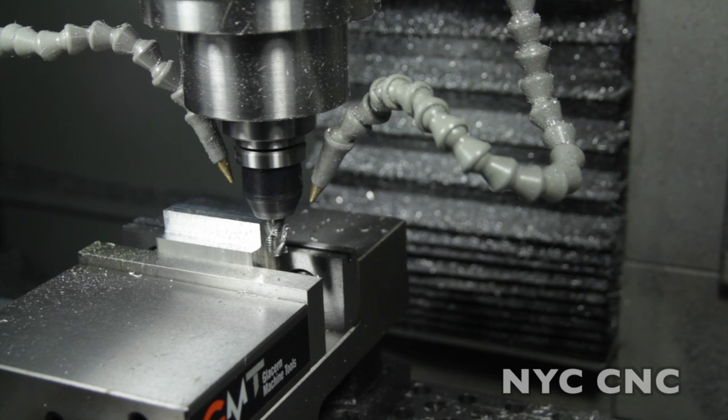Yep, that's all we're going to get. That should be 1.13 horsepower. I told myself making this video that I'd be okay if I broke the end mill, but I don't think it makes any sense to push it harder than that. You can clearly hear the spindle is under strain. What's interesting is that even though the spindle gave out running at 1.13 horsepower here, when we ran the cut at 0.3 inch depth of cut at 47 inches a minute, that was actually 1.2 horsepower — a higher horsepower and a higher material removal rate of 5.6 cubic inches. Whereas what we just ran — half an inch depth of cut at 27 inches a minute — was only 5.4 cubic inches. Both are great numbers. I would highly encourage you to look at software like G Wizard that can help you evaluate how to maximize material removal rates.